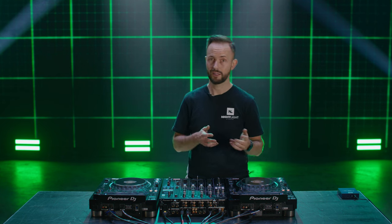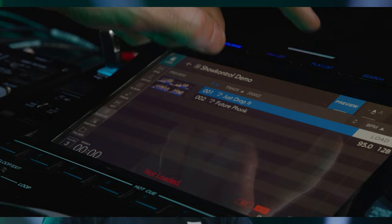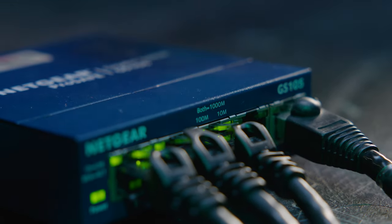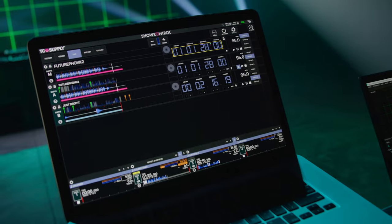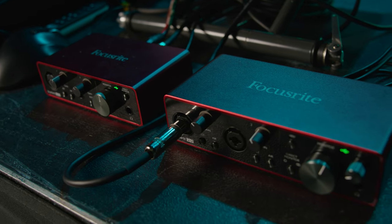For instance, decks numbered 1, 2, 3, and 4 left to right, or with just two decks using 2 and 3. Next, connect your USB stick with content from the artist. Press Source on all of the decks and select the correct source for music. Once each deck has a unique deck number assigned to it, connect all of your CDJs to a network switch. Now the CDJs should be set up for show control. The last step is to run an Ethernet line from stage to front of house. Over at front of house, connect the Ethernet line running from stage to our network switch, then connect it to our show control laptop.